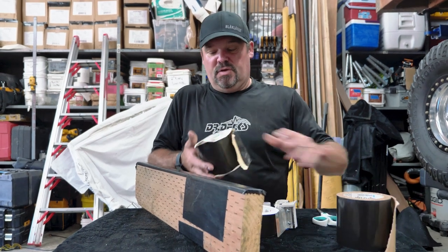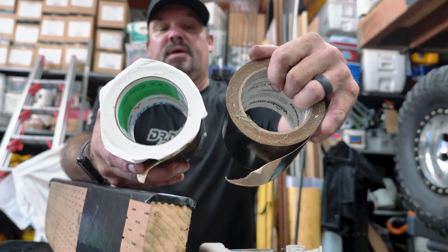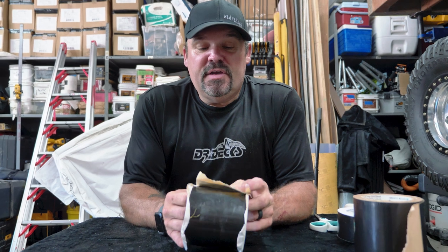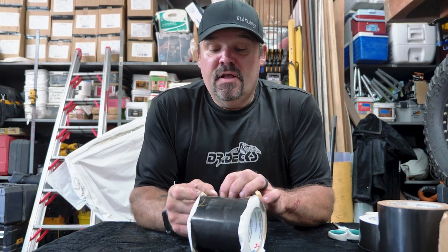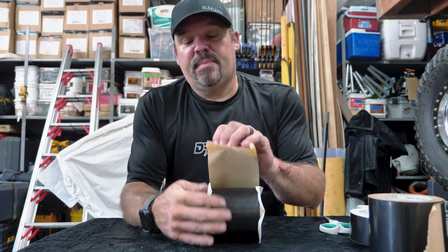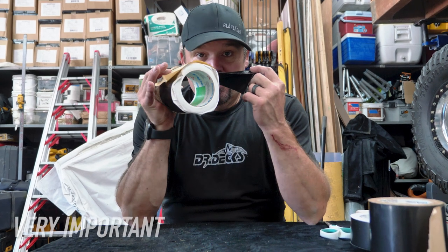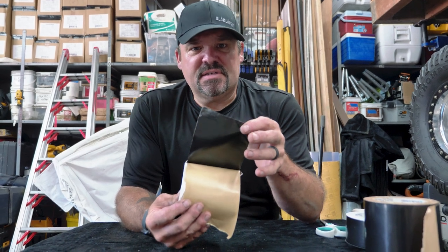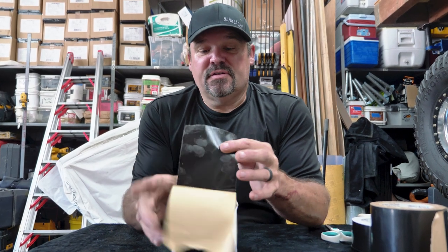The last roll looks a little different on the inside than the 3040. This is an EPDM-compatible tape called 3045. It's a little bit thicker than 3040, it is paper-backed, and it comes in two, four, six, nine, and twelve inch widths. It smells a little different — not offensive, just kind of weird — and it has a really good super tack to it. Because it's thicker, if you're doing waterproofing it works really well.